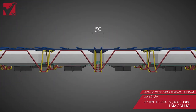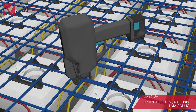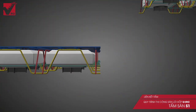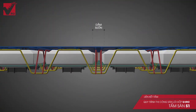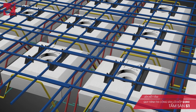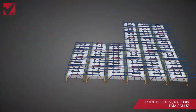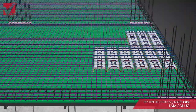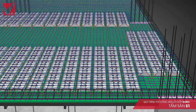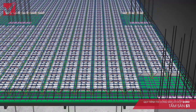The S VRO panels are installed in succession, fixed in their positions with steel ties at a distance equivalent to a structural rib. Two consecutive panels are connected by ready negative-positive steel ties. The panels are prefabricated with suitable size modules that enable them to be easily transported and installed. As they already have a steel mesh structure, there is no need for upper strengthening steel as seen in other types of slabs.